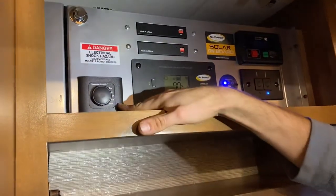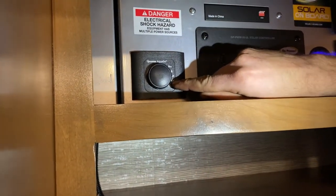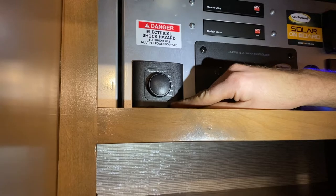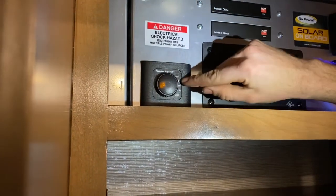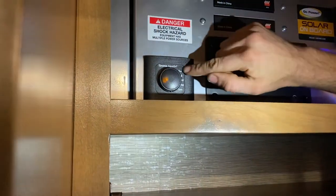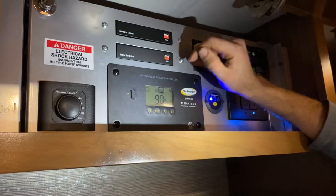This is your water heater switch for your instantaneous water heater. The off position and two bottom switches you're not really using: one is for winterizing without antifreeze, and the other is a cleaning/decalcifying mode for calcium buildup. The two main modes are: comfort mode — basically on, the light comes on but won't heat water until you run hot water — and eco mode, which uses less power and cycles gas on and off more often but still heats water well, just more conservative on gas.